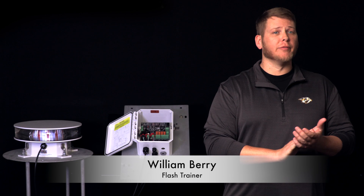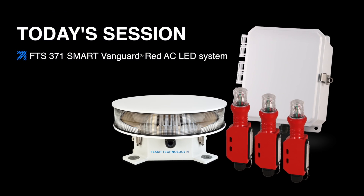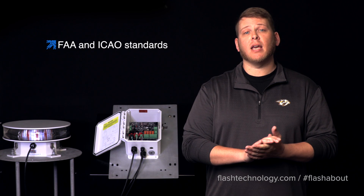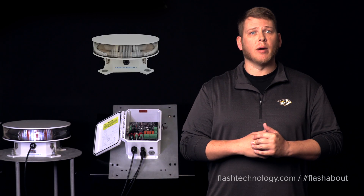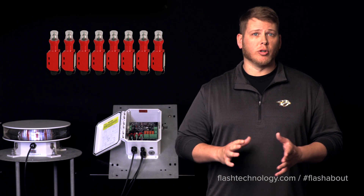Welcome to Flash University. In this installment we're going to talk about the FTS 371 Smart Vanguard Red LED System. The 371 Smart is designed to meet FAA and ICAO lighting standards. It comes equipped with three dry contacts for alarm monitoring, as well as Modbus through RS-485 or SNMP. With the addition of an FTM 190, the 371 Smart can operate up to two red LED beacons and up to eight LED side markers.